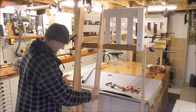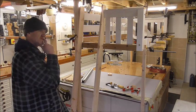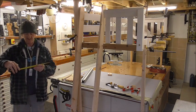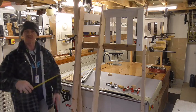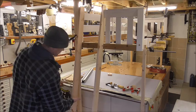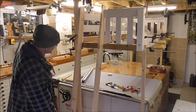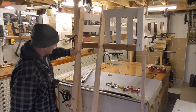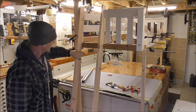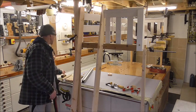Okay, I've got all these set now exactly how I want them. I've marked it out at 7-inch spacings. What's 7 inches? 175 mil? I can't remember. Yeah, 175 mil. Right. Set it out 175 mil. 7-inch spacing is what we do normally for treads, so I've set them up. Coming up 175 mil from the bottom, 7 inches from the cell. And taking it to here. I don't want him to have one that he's going to be tripping on and having to try and get over the top hole. So here is ample to the mattress, which has given me 8 treads.